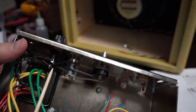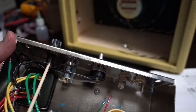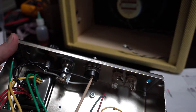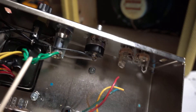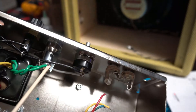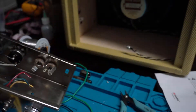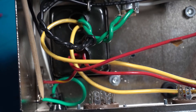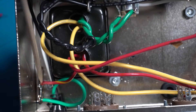Got the two black windings coming off the power transformer soldered - one went to the fuse, the other went to the second post on the back of the volume/power switch. Got the two filament power wires coming off and hooked onto the lamp. They're not soldered yet but I did pre-tin the leads and they're just mechanically in place right now. Got the center tap and the main ground coming off the main power cord - both soldered down to the lower left grounding tab.